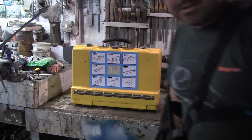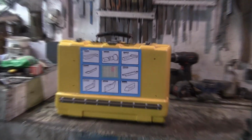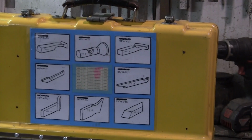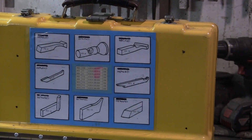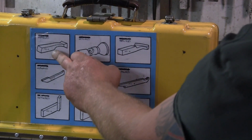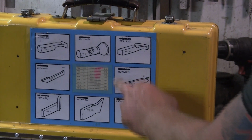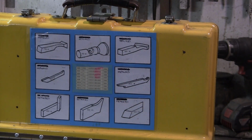These are dollies or bucking bars, as they're also called. They are anvils, basically, for solid riveting aircraft back together. And this is a specific set, so we've got a couple of them here too. They're pretty standard shapes, and then the other 6 are pretty peculiar shapes.